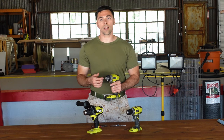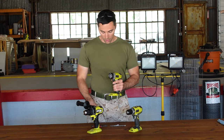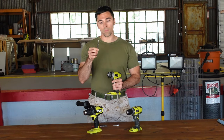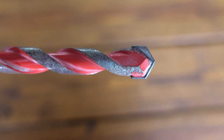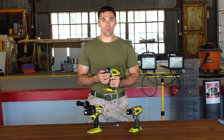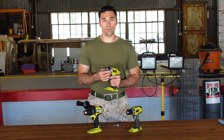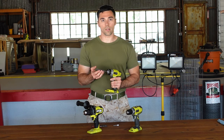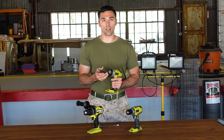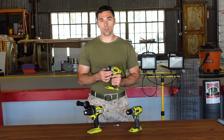It might be confusing that hammer drill bits, which are made to withstand concrete, often say they are compatible with both hammer drills and impact drivers. You can put a hammer drill bit — identifiable by its chisel-type shape at the tip — into an impact driver by simply sliding it in place. Even though it doesn't work the same way as a hammer drill, the impact driver can still generate a large amount of torque, and these bits are made to take that force. So if you don't need the tapping action on concrete, the impact driver can still drill a hole. But it doesn't have the added benefit that the hammer drill provides.